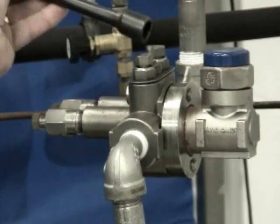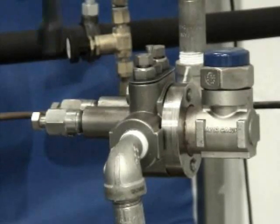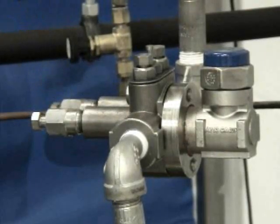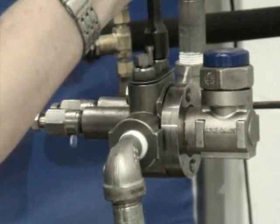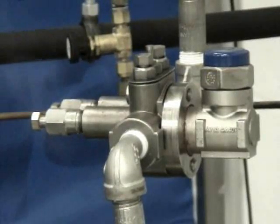At the same time, if you're going to do that, you could replace the valve assembly in that particular unit if it's not holding tight. You may also want to, if you're not getting a shutdown, open and close the valve a few times with that blowdown valve open to check it — open and close, open and close. If there's a piece of dirt or debris lodged in that valve, typically it would pass through the system. If you do that and it does not shut down, do not attempt to loosen the trap because there's a possibility of being burned.